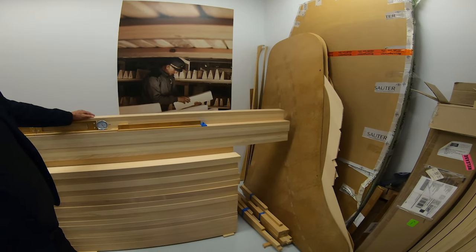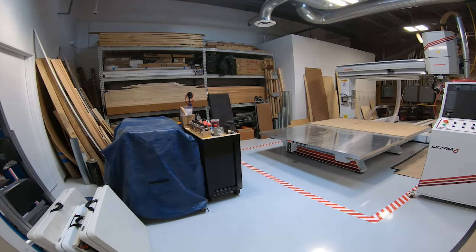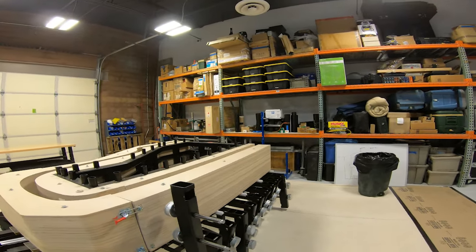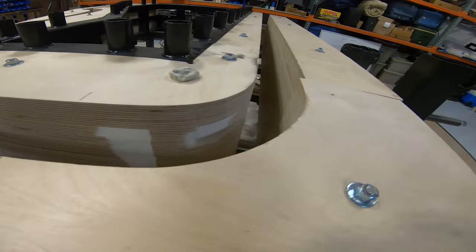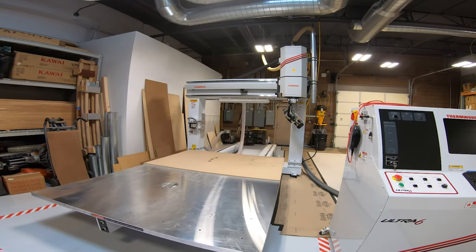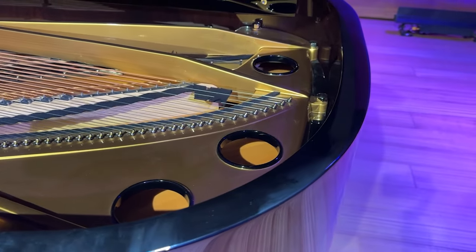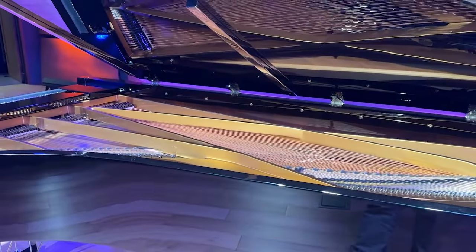This wood has a unique sound character. To bend the rims, we glue those 18-foot maple strips together — about 16 in a stack — and six strong guys bring the stack across the back, pulling and bending it into shape around this form, which is the shape of our newly designed Model 220. Once the glue is dry, the rims come out of the press and move to this CNC machine. My son Andrew and I work together to build the pianos — everything that benefits from hands-on work, we do ourselves, and for other parts we use the CNC machine. That's how we create Ravenscroft pianos.